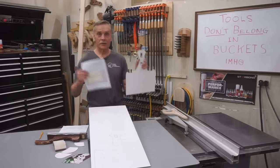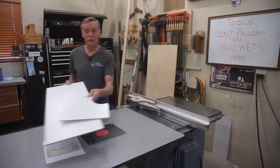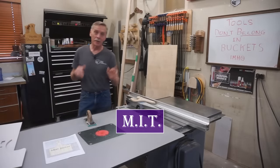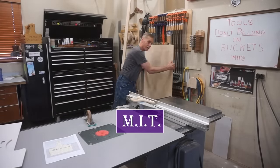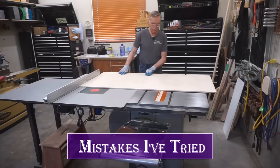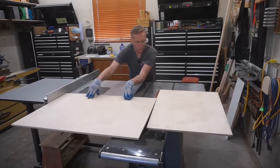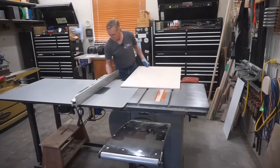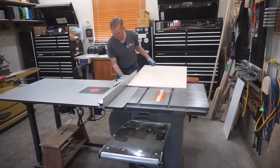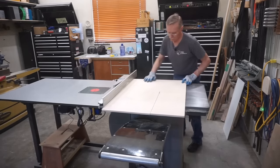And with that little rant aside, it's time to put this template to work and shape ends for a master carpenter's tool tote. And besides that, I've got a hard-earned degree from MIT, so I can tell you exactly what to do next, and that is to take a piece of half-inch Russian birch plywood and cut two pieces exactly 12 inches wide and about 16 inches long, just like I did for the template, for a pair of ends for each tool tote I'm making. In this case, I'll cut six ends so I can make three matching master carpenter totes.